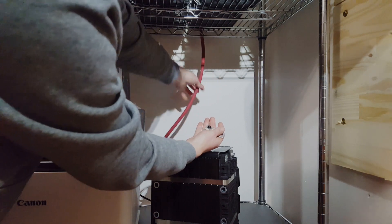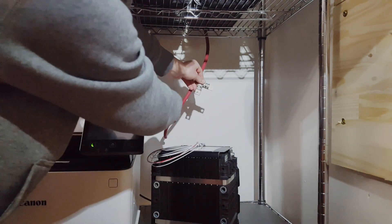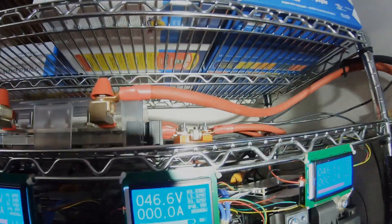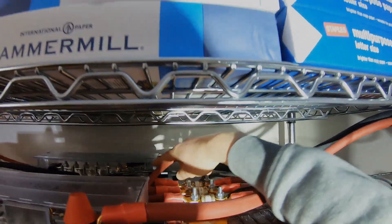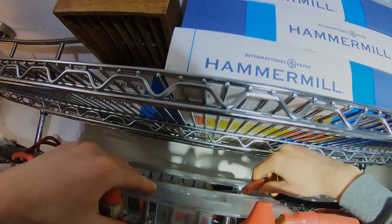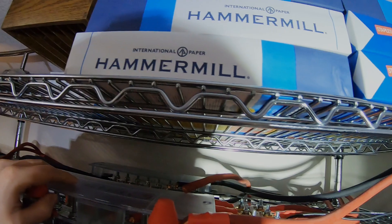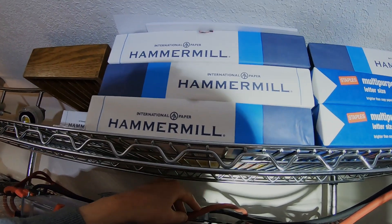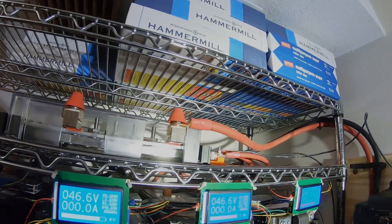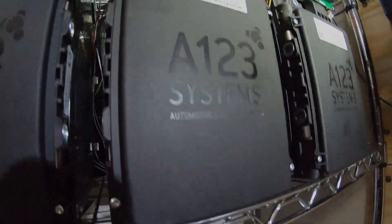I might end up trimming this down so the cable can split out with two separate leads going out. That's going to run from here up the back and then connect into our main positive bus bar. I didn't run it the same as the original build, but it doesn't make sense to use twice as much cable for two strings when a one-gauge wire is capable of handling 100 amps and we're never going to see that on these. Let's get our cable lugs on.